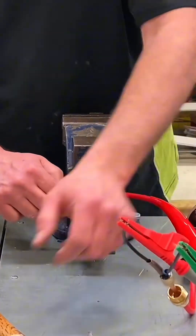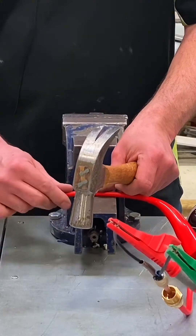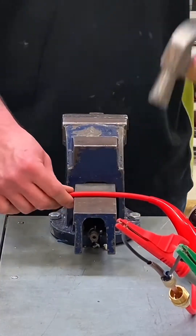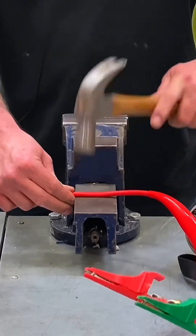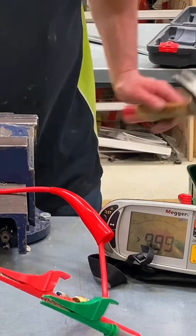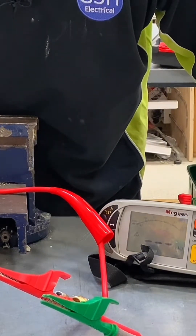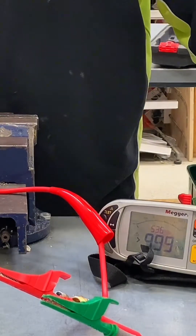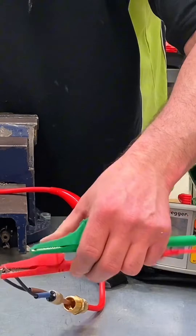So what I'm going to do now is give it a few little whacks. You might find that I drop the sound off at this stage because obviously the mic's going to be here, but I'm going to give this a few little whacks. Now see it isn't round — so we'll give it a little bit of a whack. Let's try the old insulation resistance test again. Well, greater than 999.